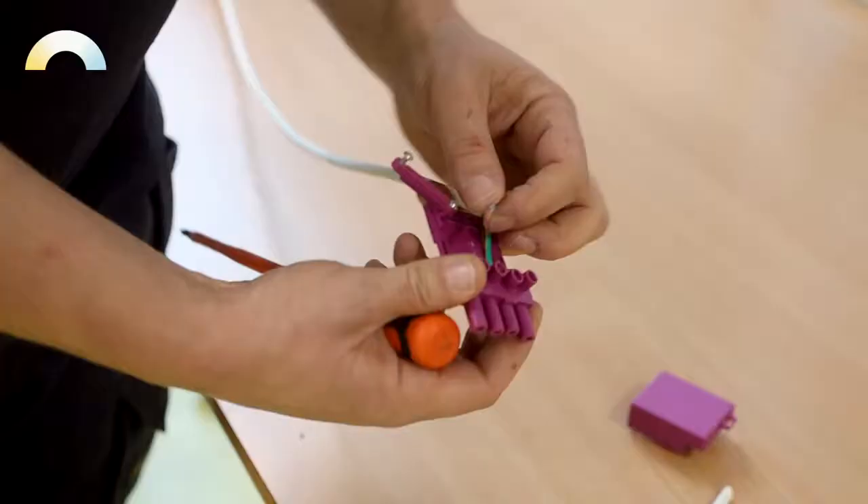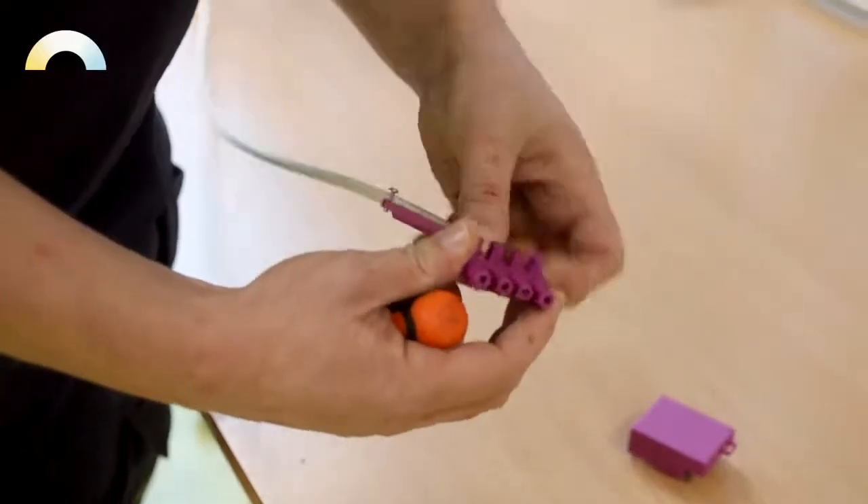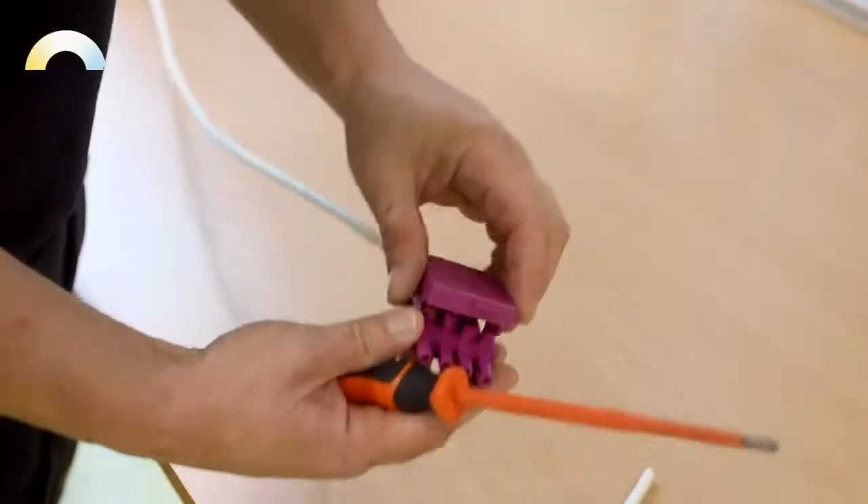The Humanitas Space panels are wired in exactly the same way as standard Robus panels. If you have those already, it's as simple as swapping one for the other, and if you don't, you easily wire into the swift connector with live, earth and neutral.